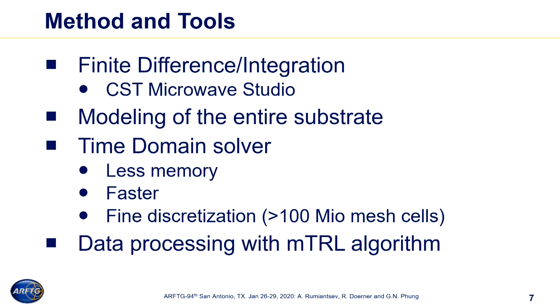Before you build something, you need to simulate it. Today's simulation tools are extremely powerful. We built all our analysis using CST Microwave Studio, and we used a time domain solver for several reasons. One of them is that the level of accuracy we needed in our calibration required extremely fine meshing of all components. We also needed to simulate the entire assembly of calibration substrates plus the probes together. For data processing, we used multi-line TRL calibration algorithms. Our reference plane was set to the end of the virtual probes, and then we performed multi-line TRL and looked at the electrical characteristics of coplanar waveguide lines as devices.